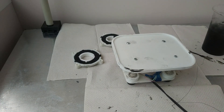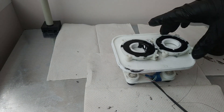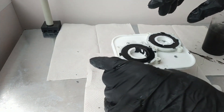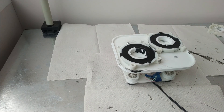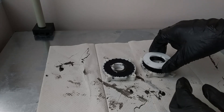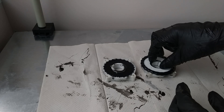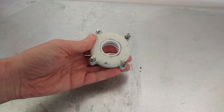During pouring, I use a vibrating table to evenly distribute the silicone in the mold segments. Now I'm adding the center section which forms the thickness and inner shape of the tire. An excess volume of silicone is also created to better connect the parts of the tire. We connect the parts and leave for 24 hours for the silicone to harden.